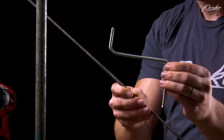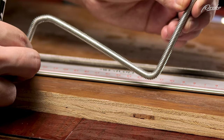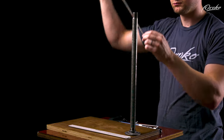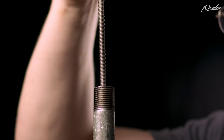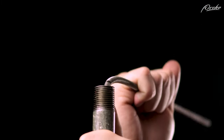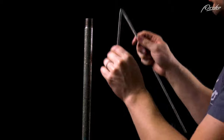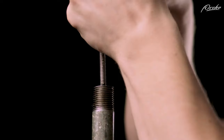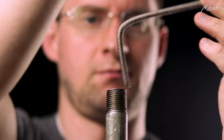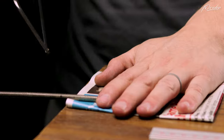Once we have that in place, we will bend out the threaded rod to the shape that we need. We are going to bend the threaded rod 90 degrees in two places to make a Z shape. The first bend is going to be eight inches in at a right angle. An easy trick is to place part of the rod inside the metal pipe so that it hits the opening of the pipe right where we want to bend the rod. This gives us more leverage and makes bending the rod much easier. Now we're going to come out six inches from the bend we just made so that we are about two inches away from the end of the rod. We are going to bend it 90 degrees in the opposite direction of the first bend, making that Z shape. Now we can use a metal saw or wire cutters to make a cut about four inches down from the first bend.